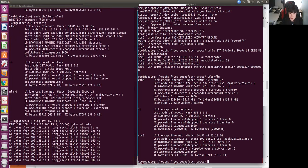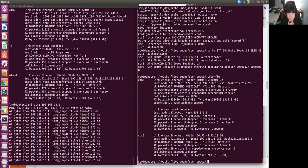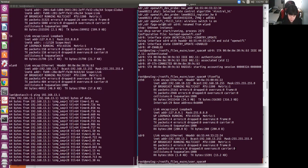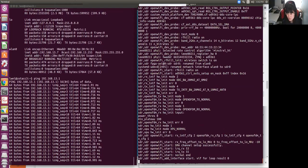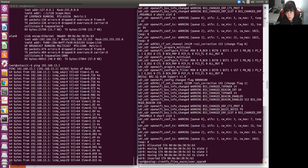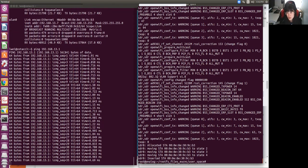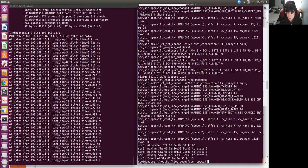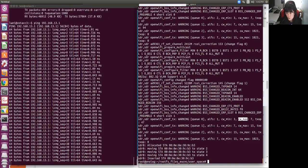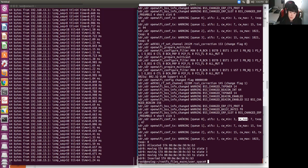Of course, we have actually already established the link, but it's always interesting to see some more configuration through the driver. So what I will do is show the kernel log. You see that the kernel log already shows that during booting time some configuration has been done, like for instance, for the host support, there's a contention window minimum and maximum for each of these FPGA queues.